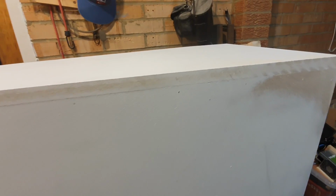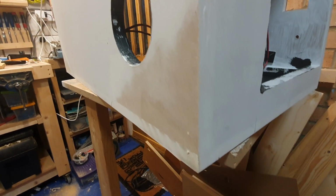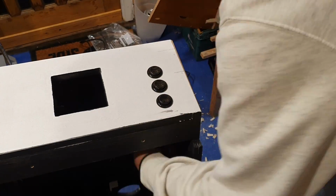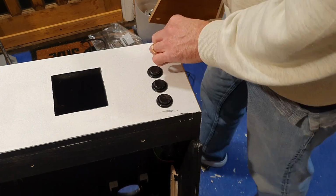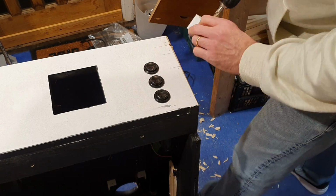The guide slid around on the corner. It was very hard to hold still under the pressure of the drill trying to move it around. I think it would be better if it was much bigger and had a flat surface at the right angle to enable it to be clamped to the corner somehow. But holding it in place with your hand does very little. By the way, drilling into the corner of MDF is a nightmare. The bit wanders all over the place.